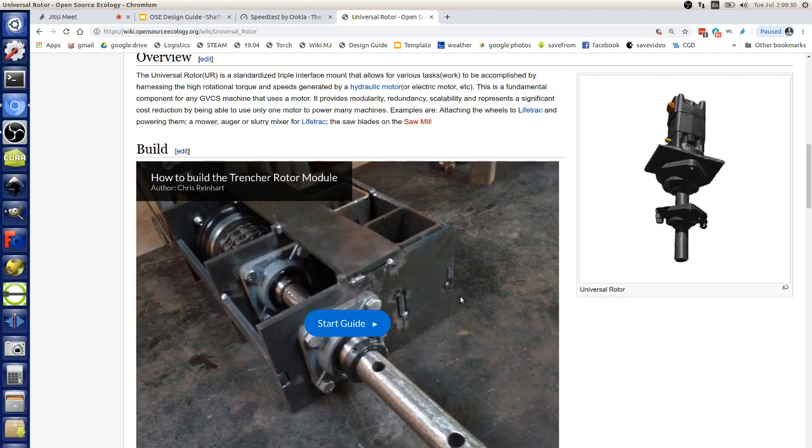How do you mount the bearings when it's super heavy? We use a number of 5/8 or 3/4 inch bolts — four bolts on each bearing — which fixes radial motion. The bolts onto the metal fix it very firmly. You can hold loads of up to around ten thousand pounds; these bearings are rated for about five thousand or so. On the end of the shaft you have more leverage — that's the lever effect. The longer the shaft, the more you're amplifying the force, so you need more distance between bearings to support it.